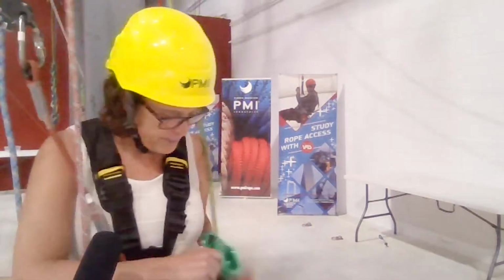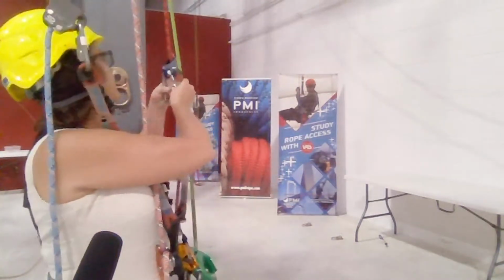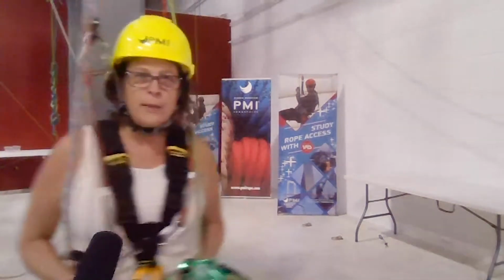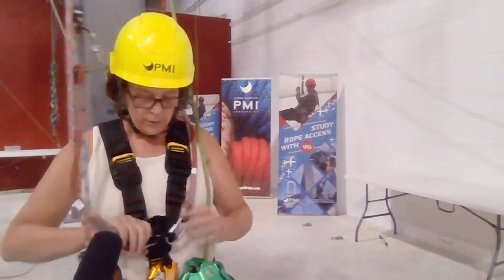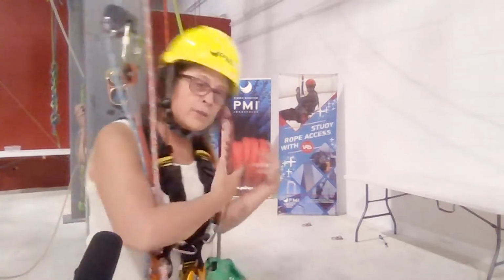So we knew from the get-go that this was going to be a bit of an issue in rope access, right? Because I'm going to grab a second set of ropes here. In rope access, we frequently attach two completely separate systems, mirrored systems of one another. We often attach two completely separate systems that look identical because when we're doing changeovers, such as rope-to-rope transfers, this is what keeps us from entering a swing fall hazard. So having these two progress systems at our disposal to play off of one another and two backup systems, both on our sternal attachment, they protect against the swing fall potential as we move from one set of ropes over to the other set of ropes. So that's the absolute safest way to do it.